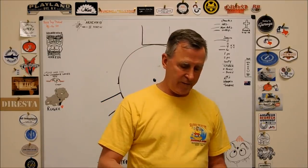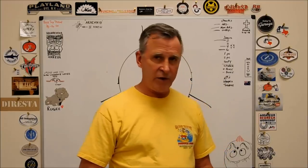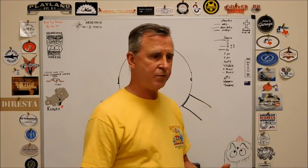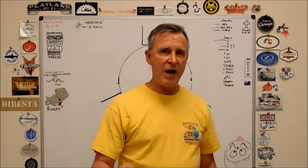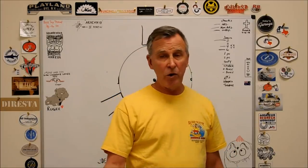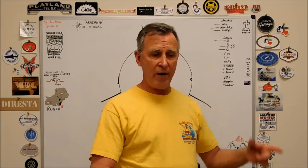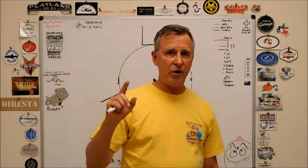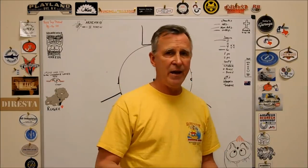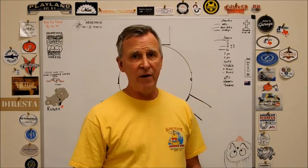This is good for forgings, castings, tubing, a variety of other parts that you're going to want to hold. It may look round, but if you're not sure that it's round, spin it and play with the key. Try it. It's a great technique. It's a solid technique, and it's exceptional technique for tubing.